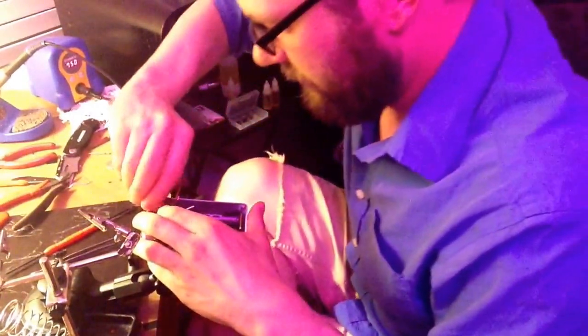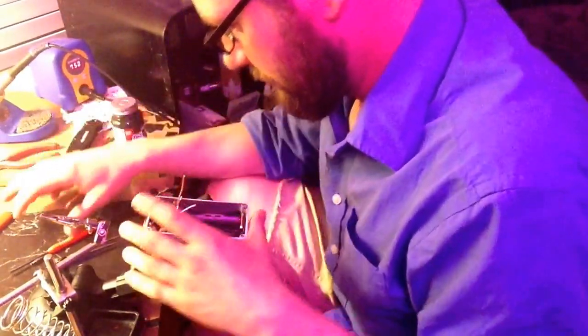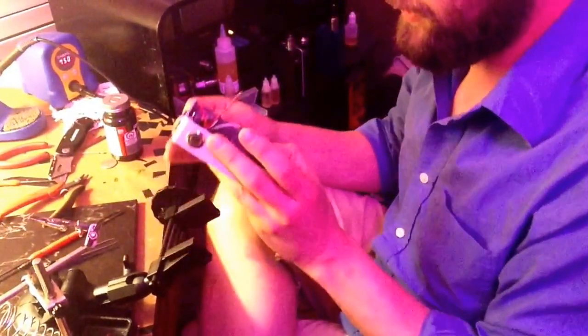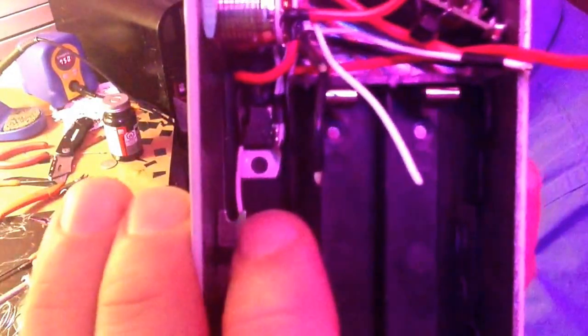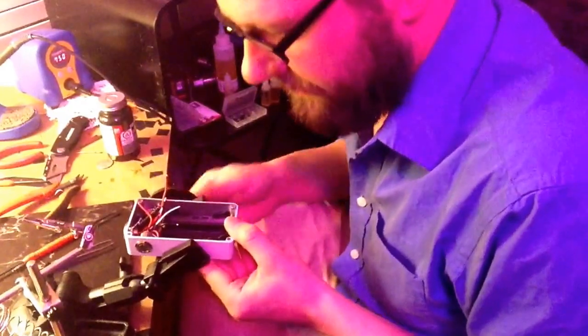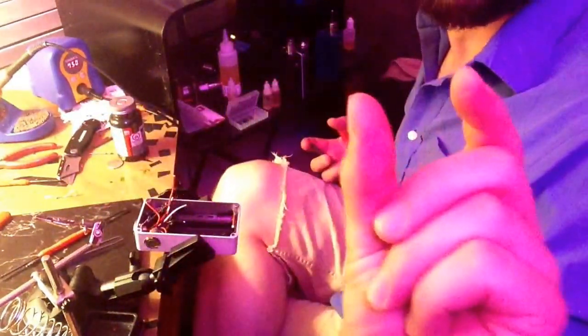Let's do the power in. That is this wire which comes off the button, which comes off the PFET, which is fed by the fuses — you dig? I actually changed the way I did things a little bit: I pull the battery for the display from the PFET. Does that make sense? It lands right there. That's how I do that now — a little bit easier, one less wire to have to bring from the chip, and it saves a lot of wire too. If you find better ways to do this, do it that way — I ain't saying this is right, just how I do it.